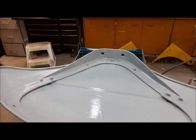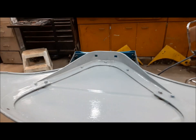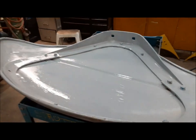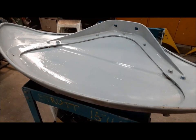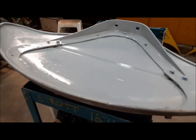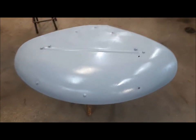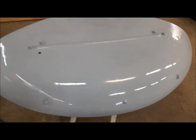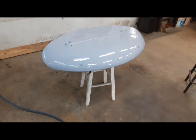There's a good step — I like to get to this point. I've got the outside of the fenders pretty much straightened out. Before we get too carried away with them, I brushed a nice coat of rust primer on the backside of the fenders, and then they'll be ready for paint. I don't get too carried away with the backside of them — you hardly see them at all. I've given our fenders a couple of coats of filler primer, so we'll let that set up for a while, and then we can start sanding them back down to where we're happy with them.